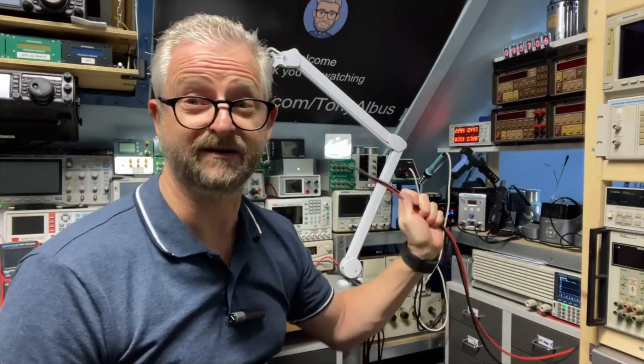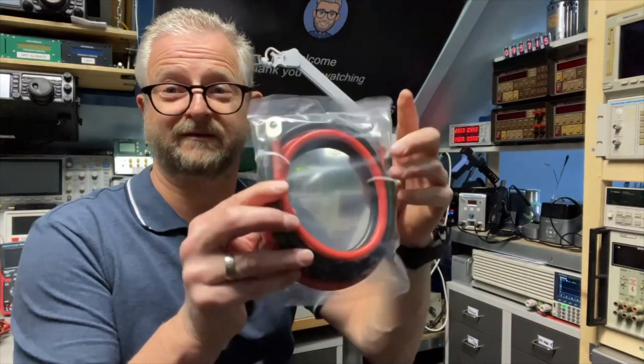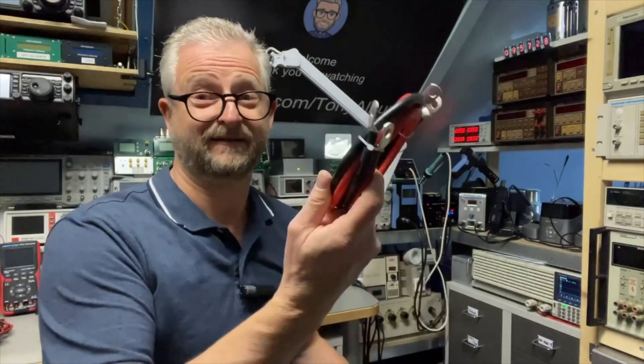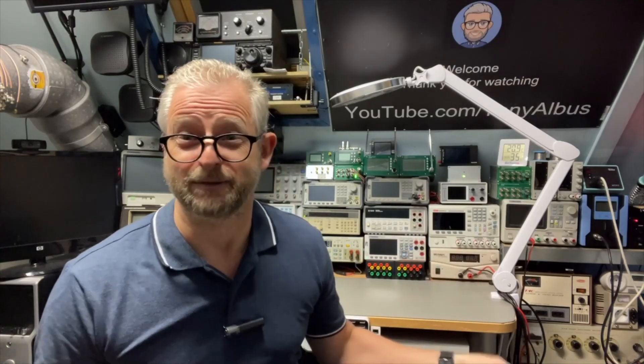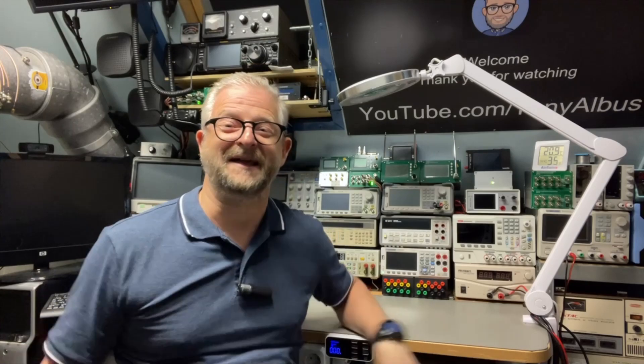When I start playing with those high currents, I have power supplies that can do that. The Korad silicon cables are AWG10, which is good for short-time 40 amps, but I wanted a little more. So I have here cables that almost look like car battery or starter motor cables — AWG6 — soft silicon, so they can do pretty much. I still need to do a reorganized lab tour. The radio section is a little improved, my 19-inch rack has different devices, and storage is greatly improved. The lab is never really done, so I just need to pick a moment. So many nice things to show — a lot of interesting stuff is coming. Thank you for watching.